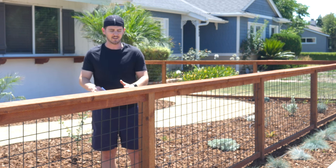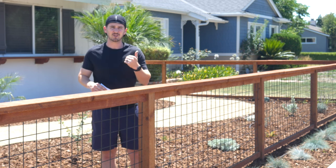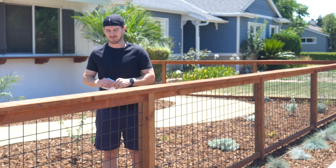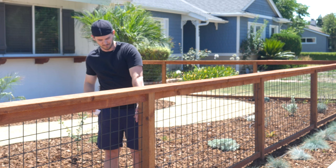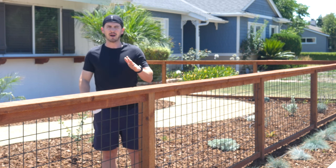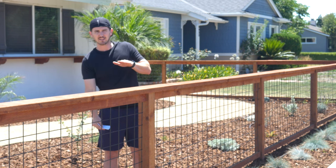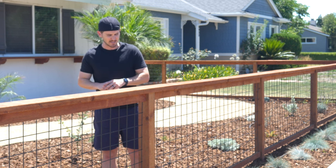If you were to try to fabricate these yourself it would be way more expensive and super time consuming, so it's definitely worth it for this style of fence. One recommendation: call ahead to the Home Depots you're visiting, even if it says they have them online, because I went to two that said they had them in stock and they didn't. The rest of the fence is built from 2x6 pressure treated wood and 4x4s mounted 18 to 20 inches into the ground. Because the fence is about 40 inches high, I read that it's good to have a third to half of the overall post length buried.